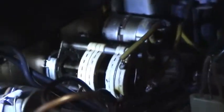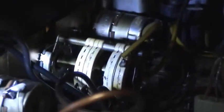And it's got all the original potentiometers in there for your volume controls. That's a stack pole switch array for your AM, FM, AFC, and phono. And you got a nice big flywheel for your tuner. And then of course your front end. You can see a little bit of the tuning capacitor back there as well, and your typical internal antenna for built-in purposes.